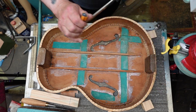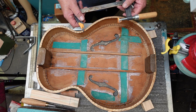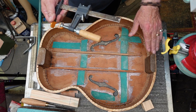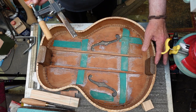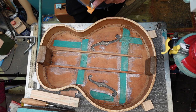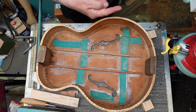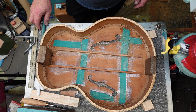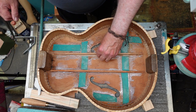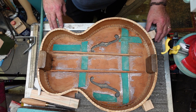The problem is when I take a clamp — you can only do this because the back of the guitar is off — by the time I cinch it down I'm not going to be able to reach inside. Furthermore, I need to be careful that if I bottom the top out and start cranking down, you're not cracking the sides or breaking things loose. So I've built up a couple little blocks here that are going to do the trick. I've got the hide glue heater going. We are going to put this in with hide glue.